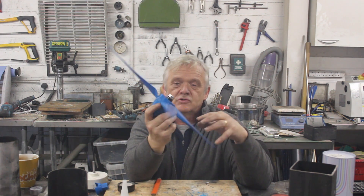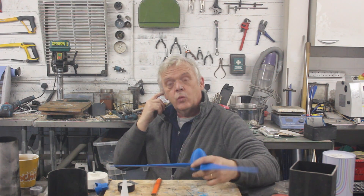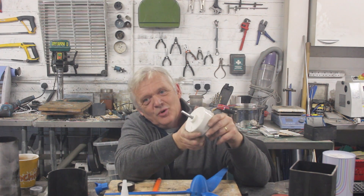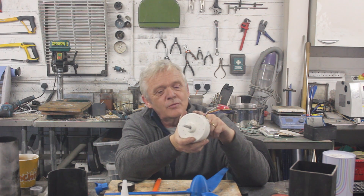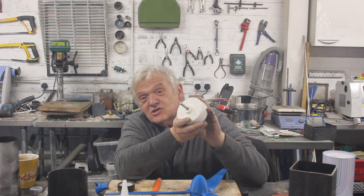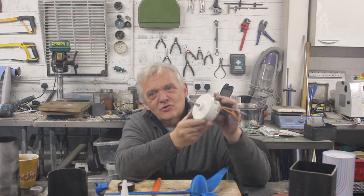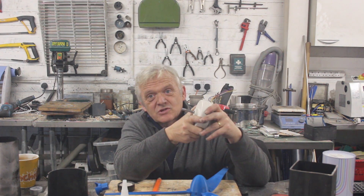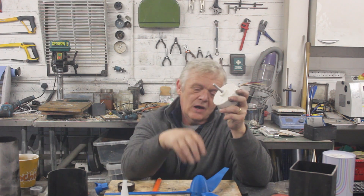In the back I've put a coupler, which was of course part of the print — it was already there. Originally we were going to put this on a bike dynamo, but that was before I discovered this motor. To be honest, it's got to be the most perfect motor I've ever seen as a ready-made generator. It came out of an air conditioning unit, so it's sealed and cast in resin — a permanent DC brushless motor meant for harsh environmental conditions, and the output is just phenomenal. I'll put the model number in the description. It's compact, it's got a high voltage output, it's completely sealed against the weather. If you've got air conditioning units that people are scrapping, this is the fan motor — just dig that out. I'll put the link in the description.